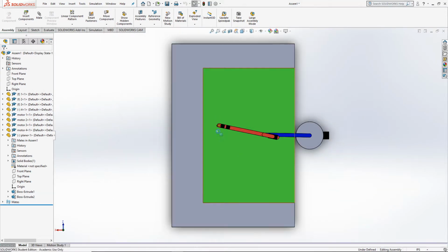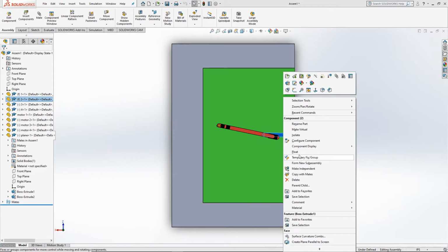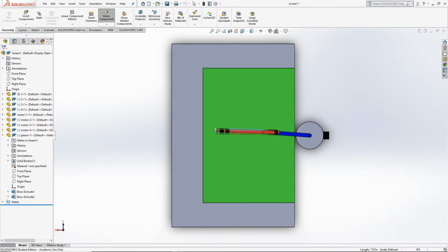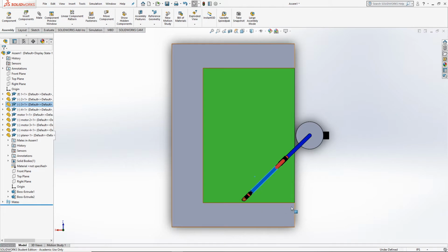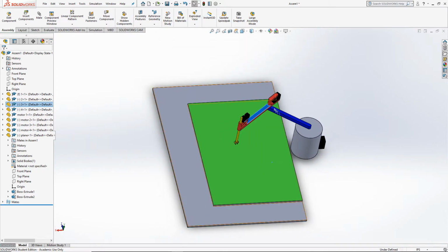If we look from the top, the workspace is defined by this arc right here, and of course by the field of view of the camera. So it would have this shape where it's like an arc, and then you have the corners cut off. And that is the workspace. Inside of this, the robot can operate. It can reach any point within this workspace, and the camera covers all of it as well.